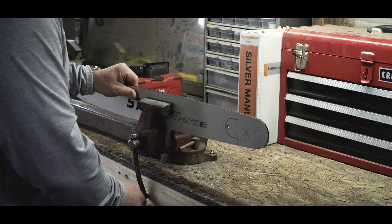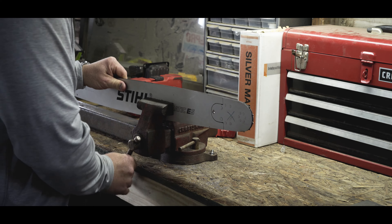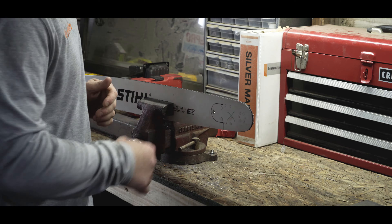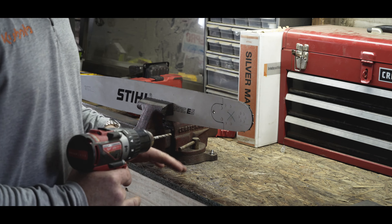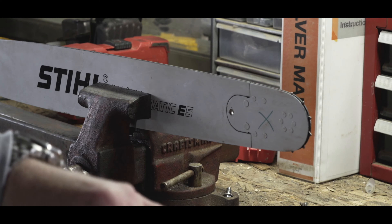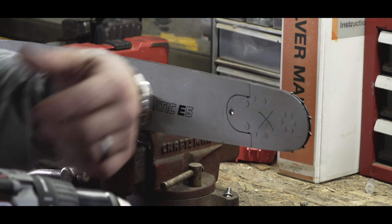With others it's going to be a little bit more dicey, so what I'm going to do is just put it in a vise and drill it out. I've already done one hole so I'm going to do the others just with the drill, just slow and easy. What I found is when you get close to coming through the other side, just reverse it and go through so you don't break your drill bit.